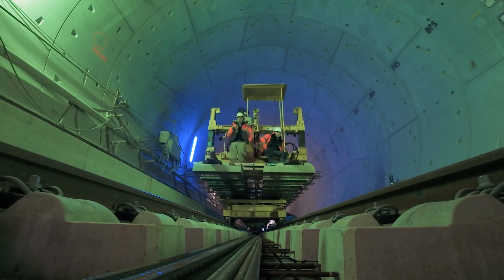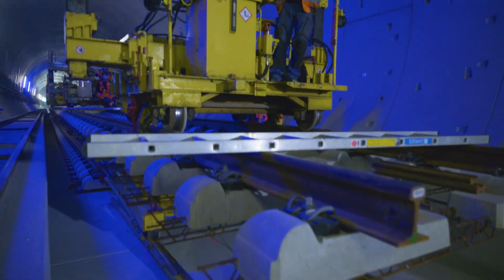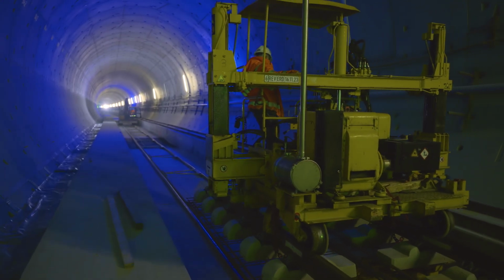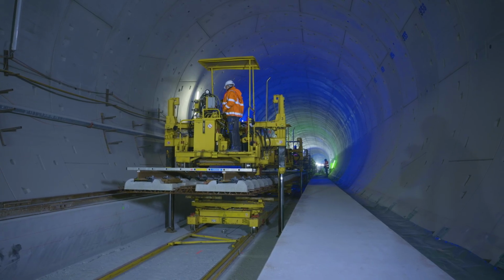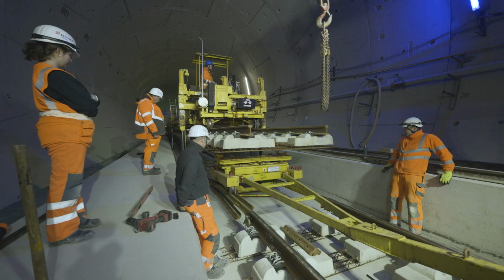At the installation site in the tunnel, the entire system is pushed down onto a provisional line of the same length from the track already laid via a connecting ramp. The track lifter rams are extended again and push the entire track section upwards. The excavator is used to pull out the free bogies onto the track already laid.